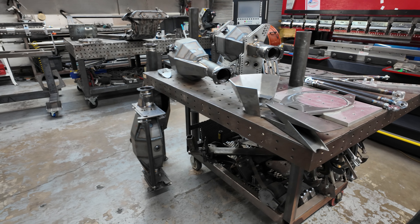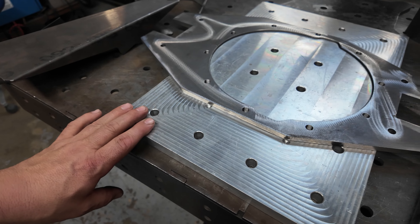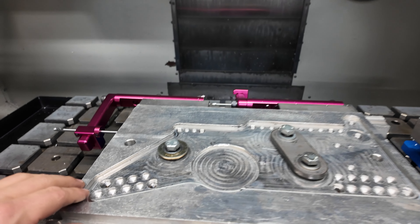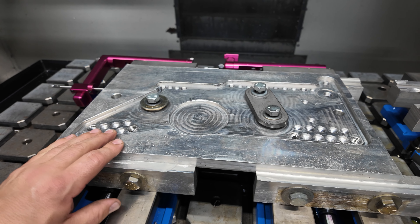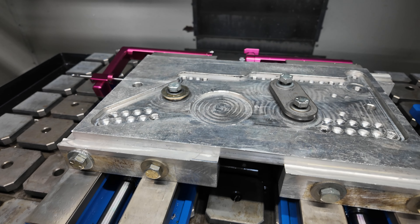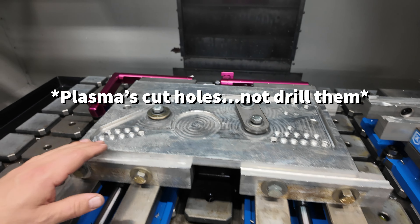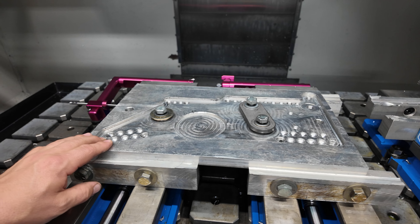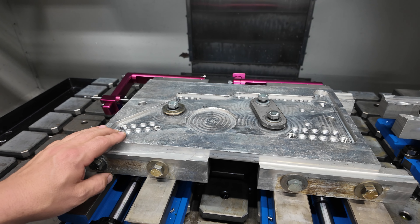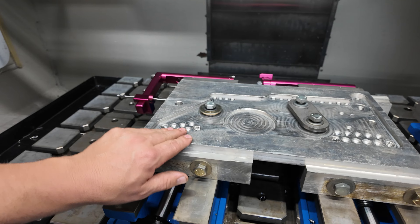Here's a giant pile of goodies — all the stuff from the beginning. Here's that face plate, and here's that fixture that clamps into this big Haas mill. Here's the four-link one — I drill all the holes in my four-link brackets too, because a plasma half-inch hole is kind of okay but you'd have to ream it after the fact. Instead of watching the plasma drill all the holes, this machine with carbide tooling drills them in about 40 seconds. It's an extra step but the bracketry is significantly nicer.